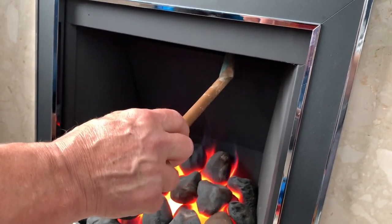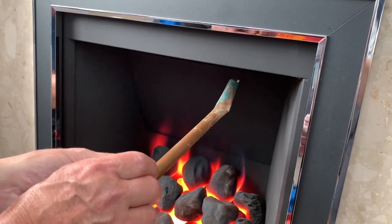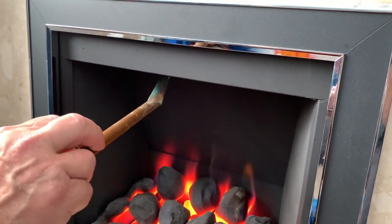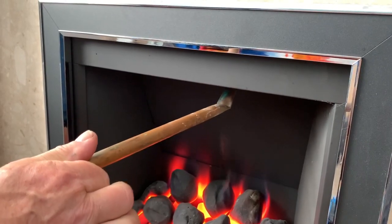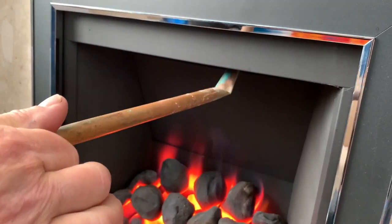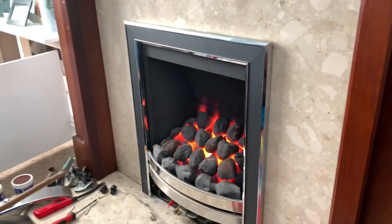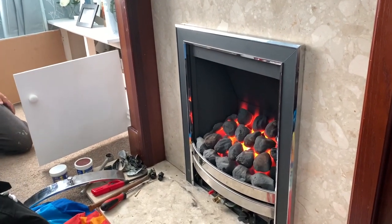So now we're doing a spillage test. We'll chop it down a bit, Anna, so we can see the smoke coming out. It's getting hot. Yeah, really hot. Okay. See the smoke's going up the chimney. Yeah. Burning, burning, burning. Go right to the edge. Put your hand to the edge. Drop it down. Okay, is that done? Yeah. And you can see it quickly took the smoke up there. So that's definitely passed.